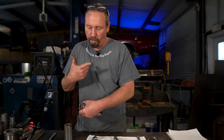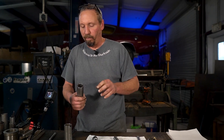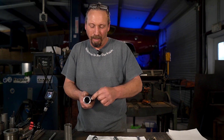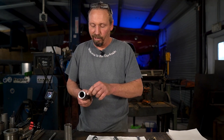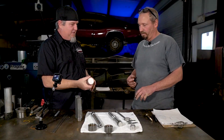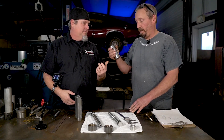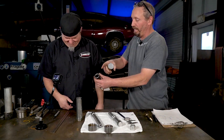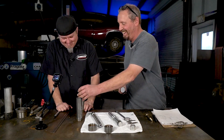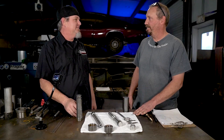On the outside here we're gonna just sand a bevel into that, and I'll machine the bevel in the butt plate when we make that. But since it wobbled a little bit, I don't want to chuck that in the lathe and try to hit it while it's wobbling — that's no good and I don't want to mess up the thread. So it's easier just to sand that one. All right, you got it all measured out, you gotta make your plate. It's gonna be a butt plate — put it on the end of the cylinder, kind of a plug. It keeps the oil from leaking out. You want to avoid that. Let's just call it a plate.